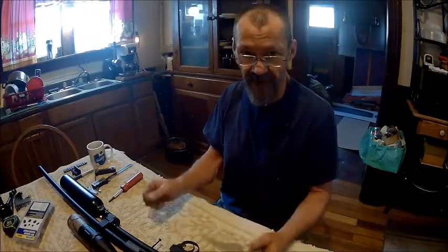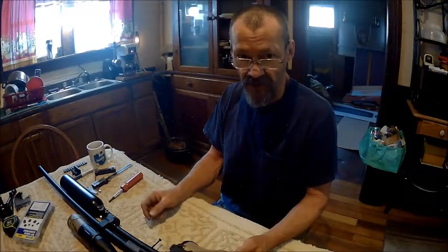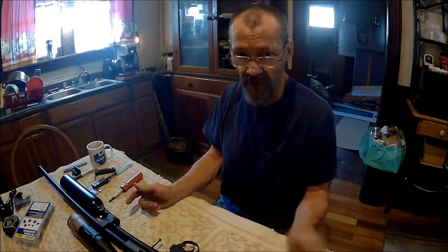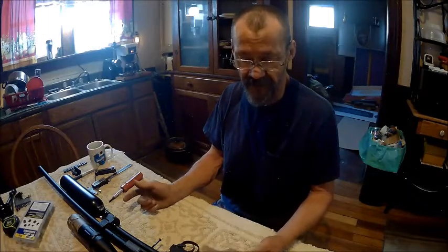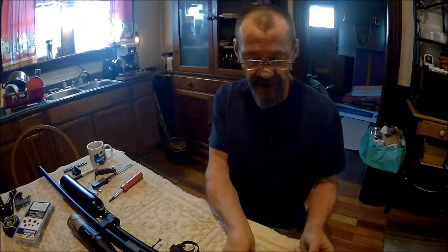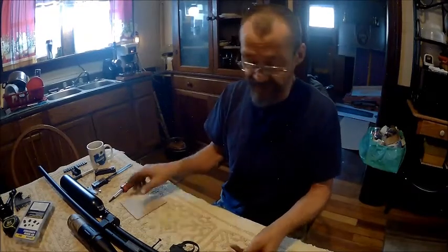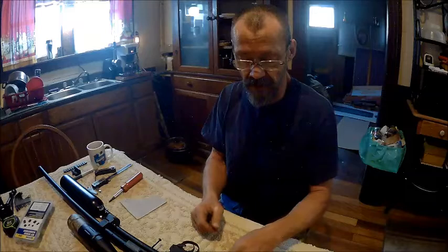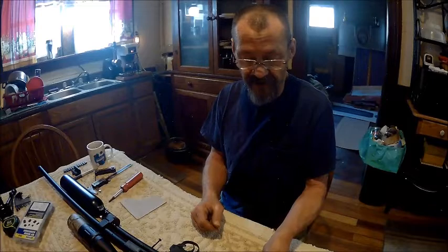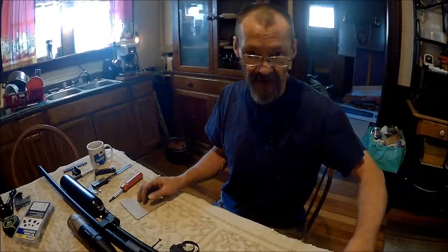So I'm thinking the same thing that I did for the bison rifle. Just thread the wood. It's never going to move. Very seldom. You're not going to be moving it back and forth all day long. You're going to put it in place, you're going to set it, and then there's going to be 2 set screws in the top that are going to tighten it down so it never moves and keeps everything from vibrating, and, you know, it will vibrate. And in fact, what I need to do is get one of them spring washers and put it in this end over here. That way it keeps tension on it and keeps it tight. But once you get the stock on it, you're not going to hear that.